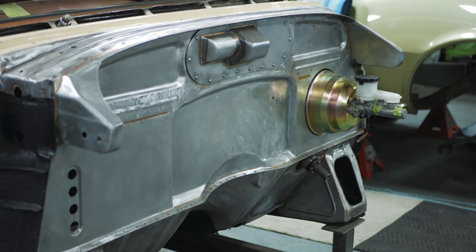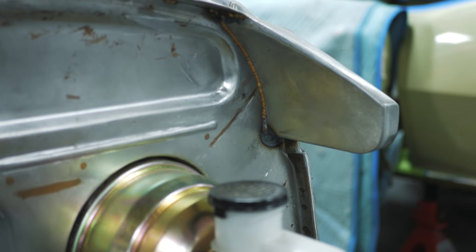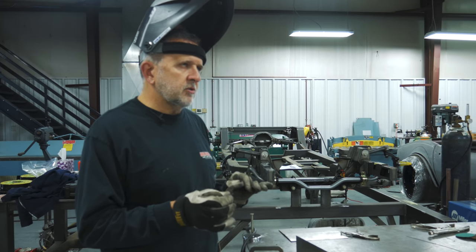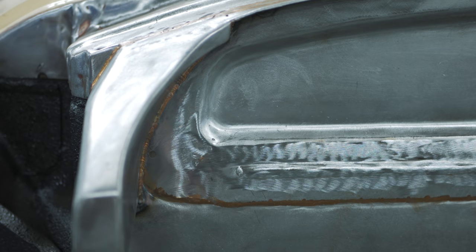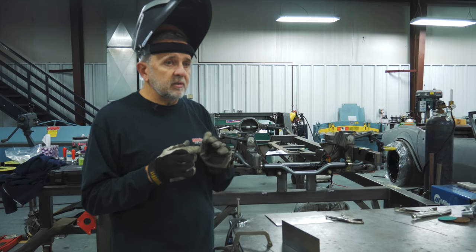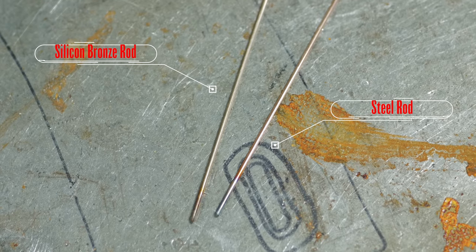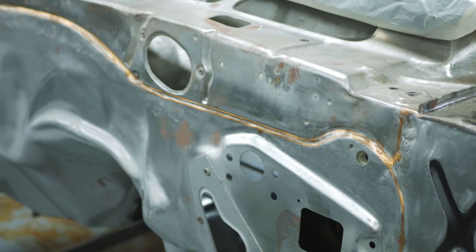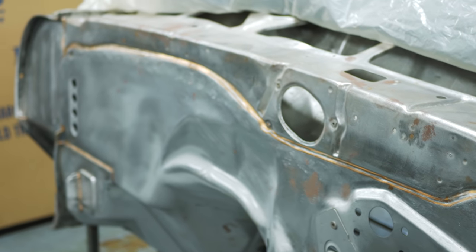It's strictly lap welds and inside corner welds only. It's lower heat, easier to grind, and it's rust-friendly. It's great for filling little pinholes — like rust pinholes in window beds or whatever. Welding with it is unique and different than steel rod. It's a combination of steel rod and maybe aluminum mixed together — kind of what I call mushy. Don't do a lot of metal finishing on it. It's not for butt welding. If you butt welded a seam and metal-finished that seam with the silicon bronze, that seam is going to break. It does have some tensile strength, but not like steel rod. It's a good general-purpose rod that I use for lap welding, especially on unibody cars.